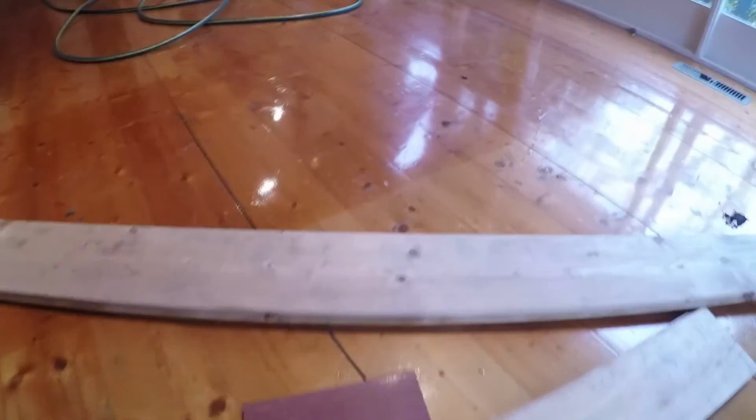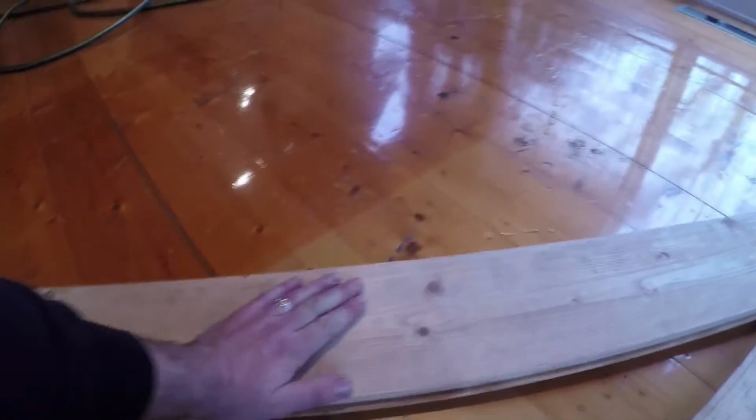Never put a floorboard straight on top of a concrete unless it's made for it, like a floating floor. That's a different floorboard altogether yet again. So overlay floorboard on the top of particle board. Solid timber can be an overlay if you want to, but you're paying a lot of money for it, or you can use it straight on top of your joist. Choice is yours. One floorboard I didn't show you earlier is this one here, which is a Baltic pine.